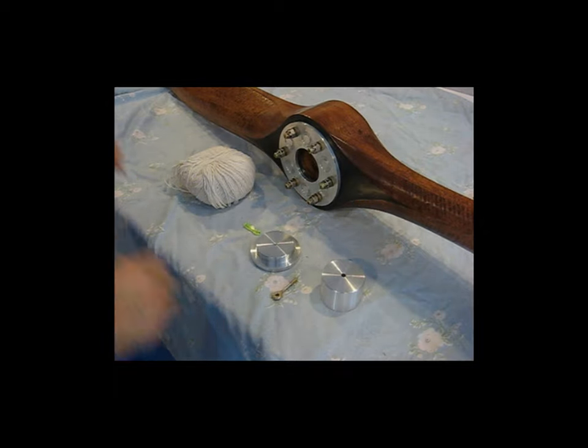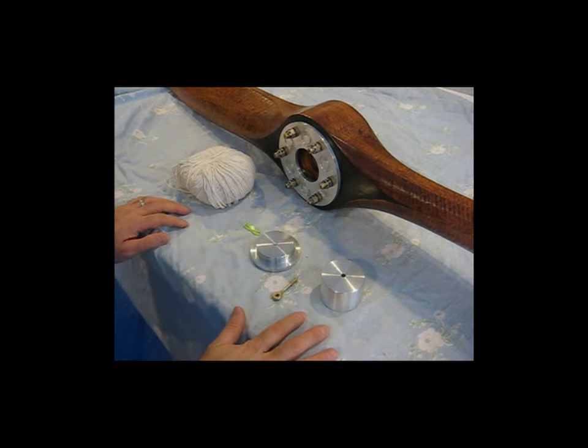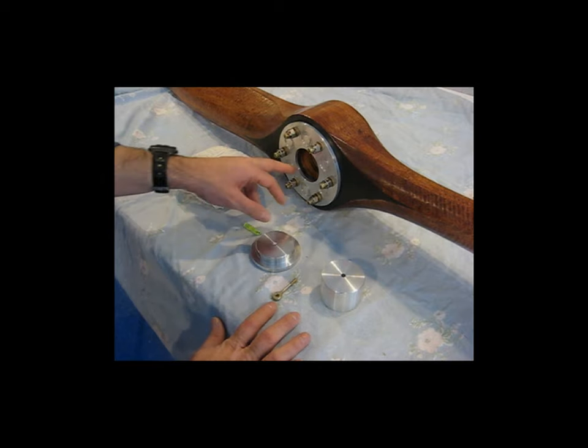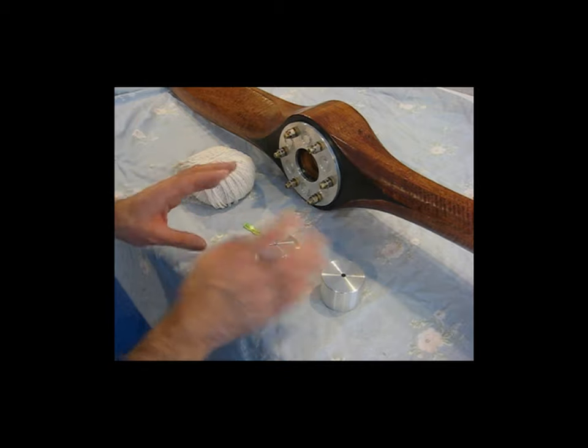What I have here are the various components I'm going to be using for my particular prop balancer. It's my own little version of a popular known balancer called the Buzzmaster. That balancer is made for propellers that have a one-inch diameter hole, and of course with our Continental-type propellers that have a two-and-a-quarter inch hole, that will not work. So I've made up my own little system here.